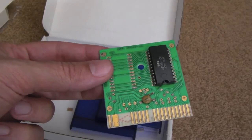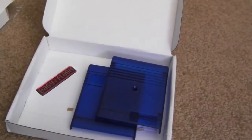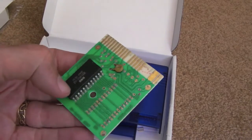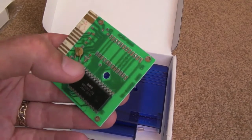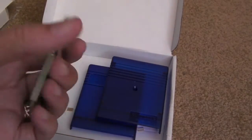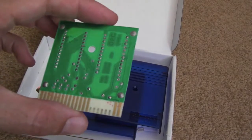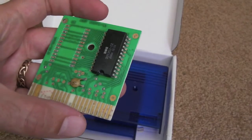That's Radar Rat Race. It's not a particularly exciting game. The reason I got this cart was that I wanted to make a diagnostics cart. I did have concerns about the size, which I looked up before I ordered this. It was only a few pounds. But the size of the image that's on here is 8K. As a result, some of the upper address lines are missing off this particular board because it's designed for 8K chips. I think the diagnostics image is something like 16K.